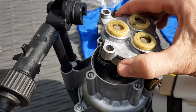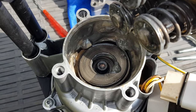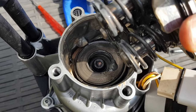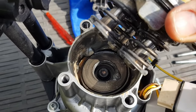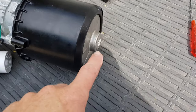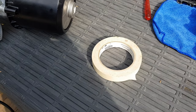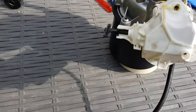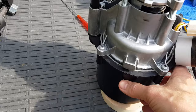When mounting this together it's really important to have some engine oil in here. You can use regular 10W-30 or 15W-40 mineral engine oil for your car, or vaseline — but it has to be oiled or greased, otherwise it will get warm, stop working, and break. Since this unit is hard to keep stable on a workbench, a small hack is to use a roll of scotch tape and place the unit inside it — that gives you a quite stable arrangement to work on the pump at the top.